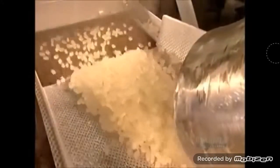Meanwhile, the dried jelly bean centers, now separated from the starch, tumble out of the drum onto a wire mesh conveyor system. It transports them to a steam belt which dampens them. This readies them for the next step, sugar coating. The jelly bean centers go into a sander drum that tosses them around, while nozzles spray them with sugar.